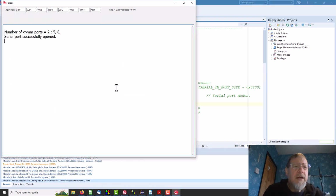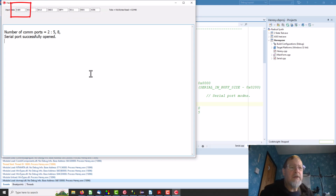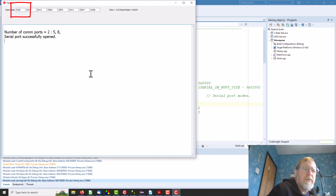There we go, and you can see I've put 7 values there at the top, which are the 6 from the strings, and the first one is the rotation sensor. And you're going to have to take my word for it because I'm turning the other camera on, but there you can see the angle goes up to FFFF and back down to 0, so that's working.